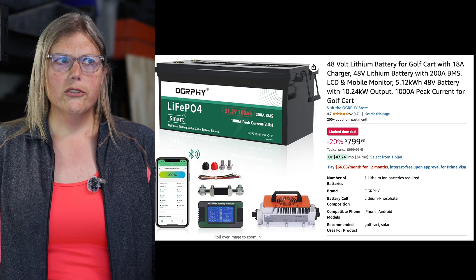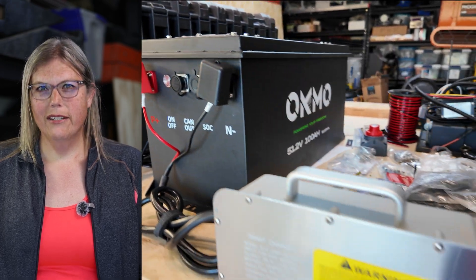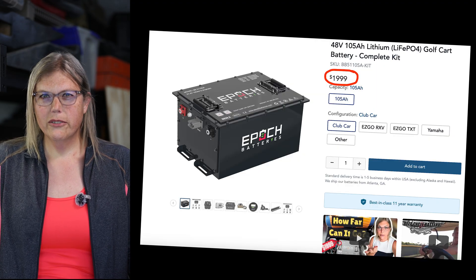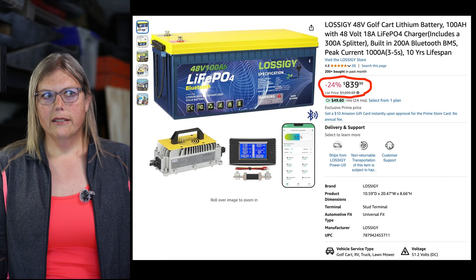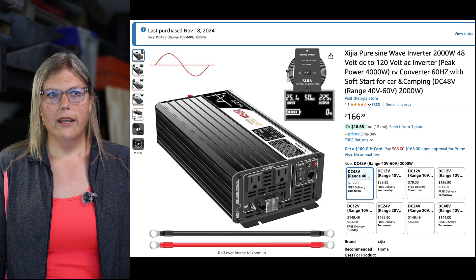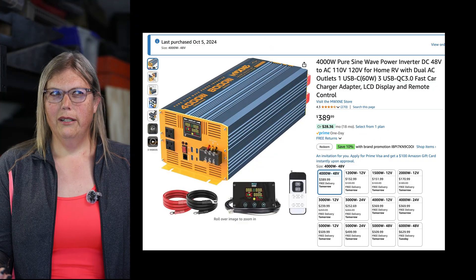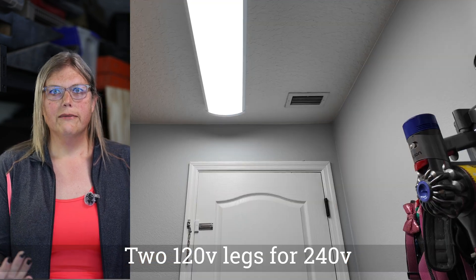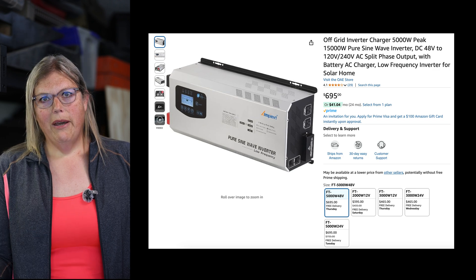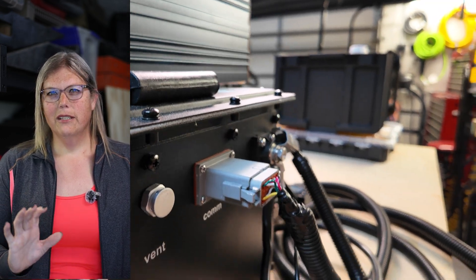In order to charge faster you're going to want a higher-wattage inverter. Let's jump into the cost. You can find 48-volt, 100 to 105 amp-hour batteries on Amazon for around a thousand bucks — I just had one sent with the state of charge meter and a 22-amp charger for right around $1,400. The Epoch one in this kit will run you roughly $2,000, but there's usually sales and discounts. The next biggest purchase is your inverter — I only needed 2000 watts so I found a 48-volt 2000-watt inverter on Amazon for only $166. I also bought a 4000-watt one for just under $400. Depending on your wattage needs, you could go with a solar inverter charger that allows you to tie it into the grid, keep the batteries topped up, and plug solar panels in for recharging.